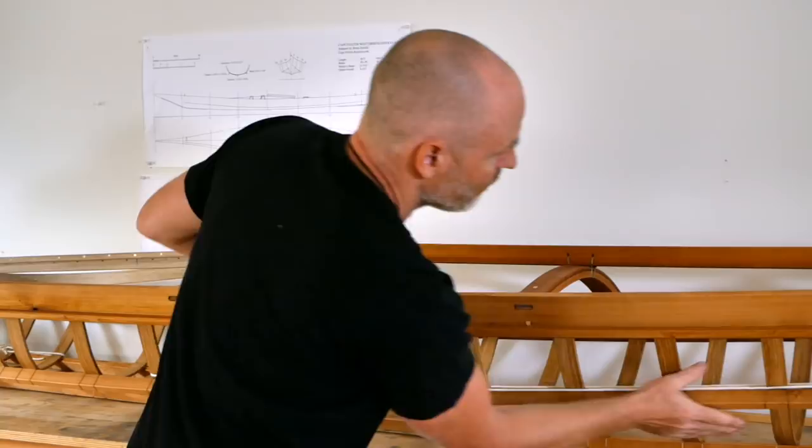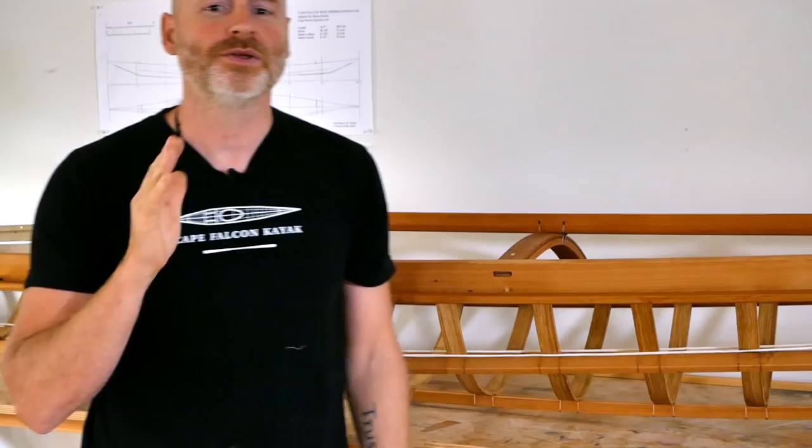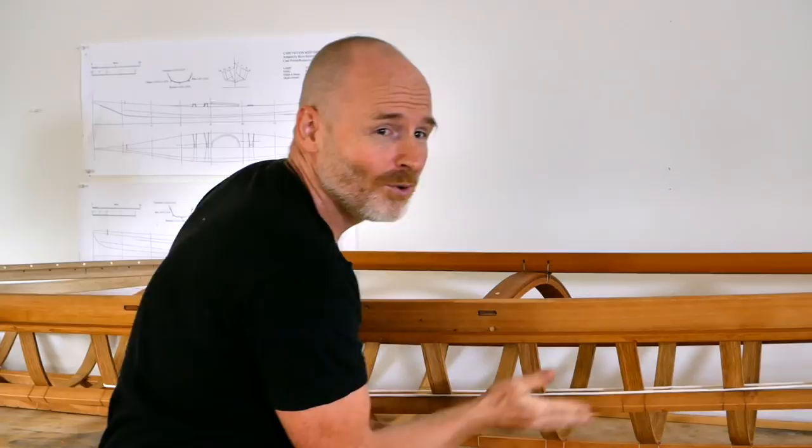I got really aggressive with the bow shaping in this boat. The most important thing about any F1 kayak is making sure those first three ribs are really V-shaped, because that allows water to transit over the chine at a very shallow angle. In a hard chine boat, if that angle gets more than just a couple of degrees, it creates a big draggy vortex and the whole boat paddles sluggishly. Also, the more that chine is sticking out, the more likely it is to bite into an ocean wave, causing that broaching behavior. By forcing an intense V into the first four ribs — to the point of cracking the mortises — that's going to really accentuate surf performance.